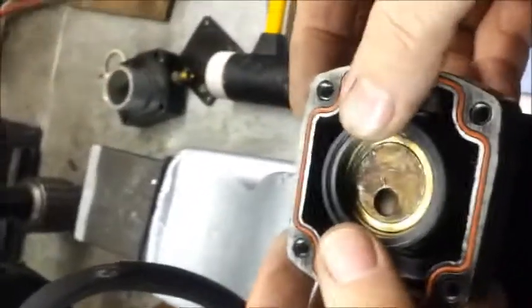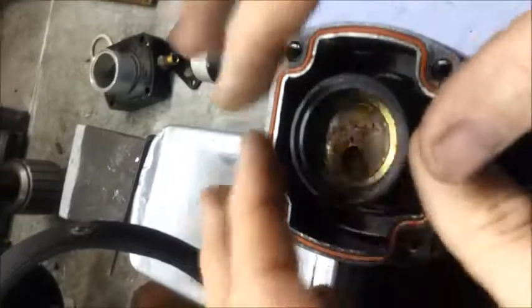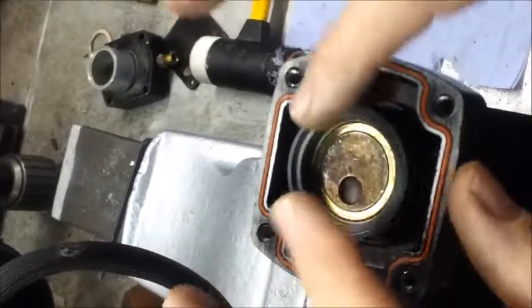If the connecting rod is not in the centre, then you could find that the seal would wear on one side and the performance and longevity of the seal may be jeopardised.